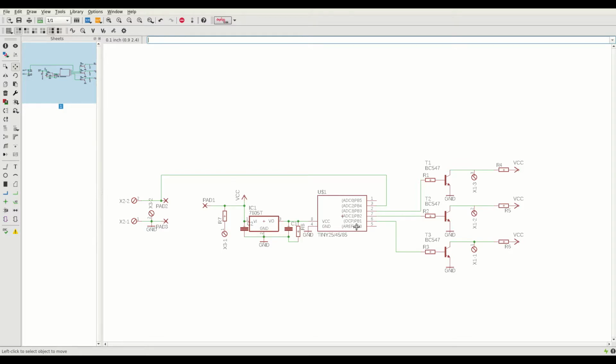What also I think is possible is to just sense the battery voltage while charging, and I have two more pins here. I could also put an end of charge cutoff in. Cut the charging voltage off at 4.2, or once it's been at 4.2 for. No, that doesn't work with lithium.